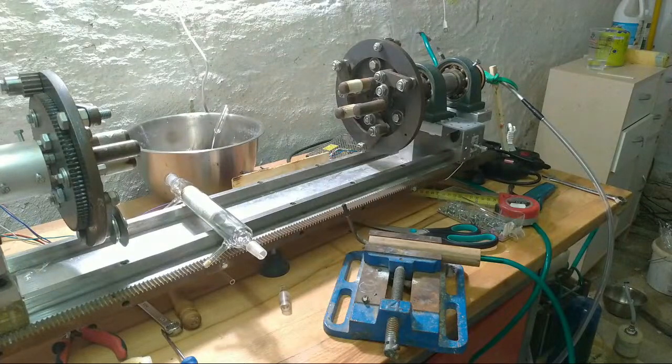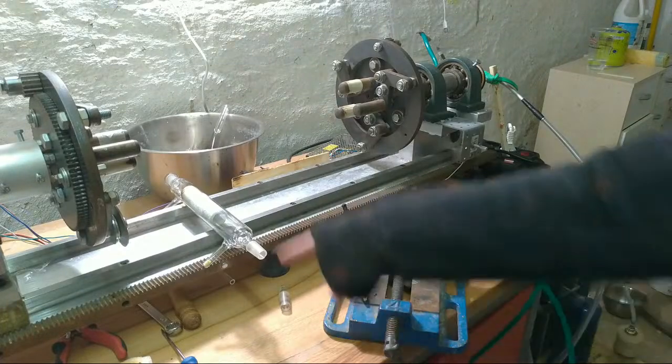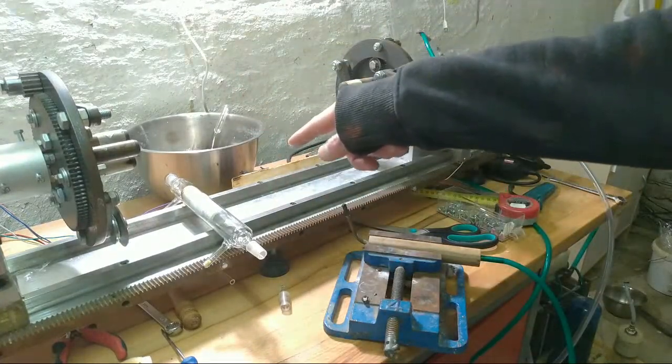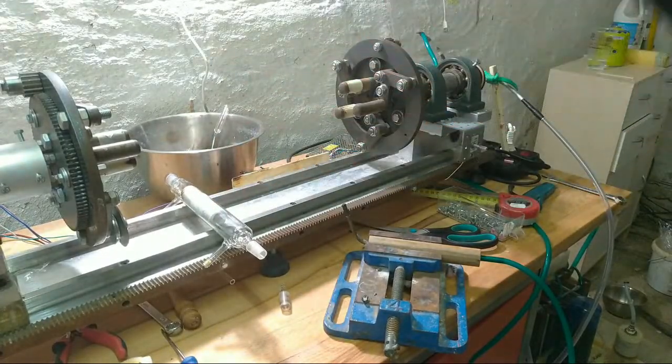I think what could go wrong there is that I don't put enough heat into the joint, and also that I don't have concentric spindles, so the glass may be stressed. I think that's a much bigger problem there. You might need thicker wall joints. Yeah. That's a beast build. Oh, I am too far behind the comments.